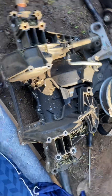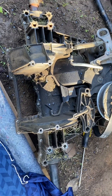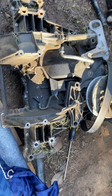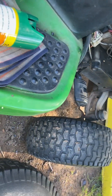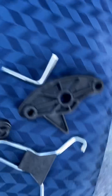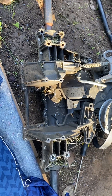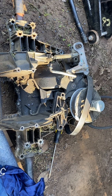So now what I'm gonna do is snap this old piece out, put the new pieces in, get this all established and cleaned up. Once I get it all cleaned up I'll be back and let you see how we're doing. The whole purpose of this is to let you know: if that pedal just flops all the way to the floor and it's not your pulleys, drop your tranny and replace these parts.